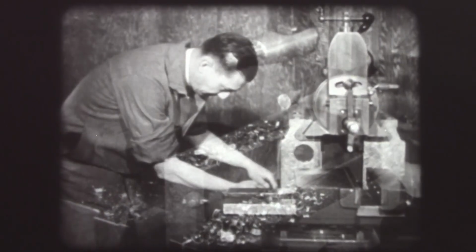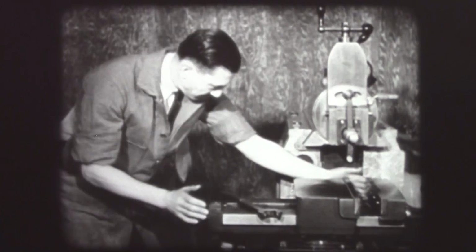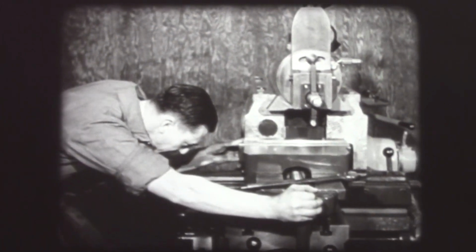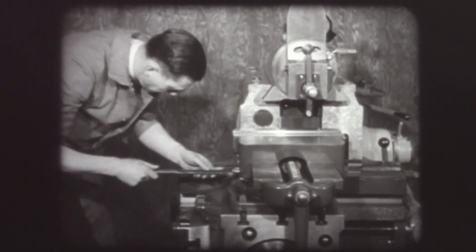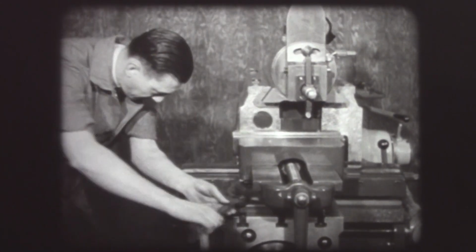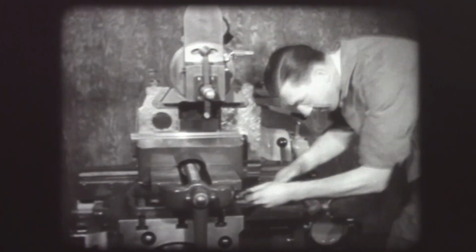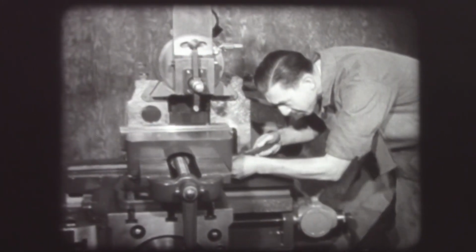In order to save time, when cutting the ends of the block, the vise is turned 90 degrees as shown by the index dial on the base of the vise. This also allows setting the piece down in the vise to get a more rigid support against the action of the tool. The operator makes sure the clamping bolts are pulled down hard.